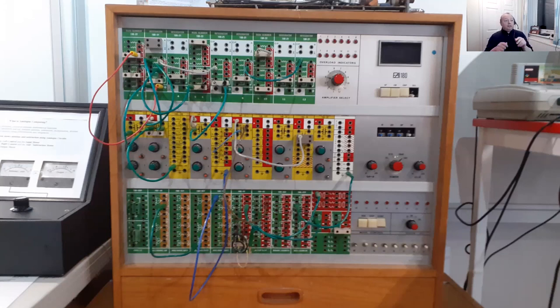You would basically wire up where you wanted the signals to go, so you could do integration, differentiation. You could work out different sums in the analog world. And the beauty of doing it in analog is it's super low power. Whereas in the digital, you might be drawing 10 to 100 milliamps, you could be down at a handful of microamps.